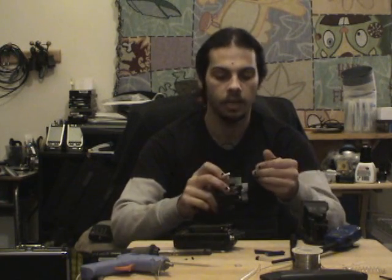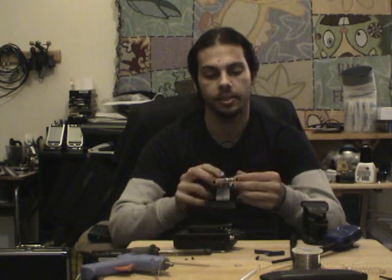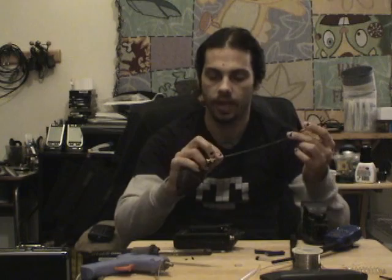Now, BNC connectors, if I haven't already stated, are very easy to obtain, and they're often used in high-end audio-video equipment. They're very inexpensive. Now, if you get a BNC connector, you can go and get something called Gorilla Glue or expanding AB foam, and you can get some kind of metal of any sort and just design your antenna that is a variable wavelength, like a half wave, quarter wave, third wave, full wave. This antenna on here just so happens to, I think, be half wave for this frequency.